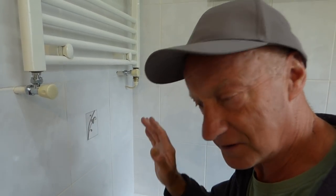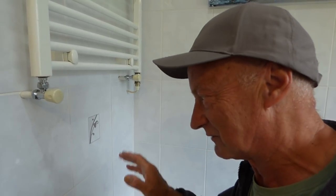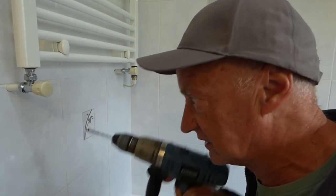And then you'll have to use plasterboard fixers. There's lots of different types of plasterboard fixers — I'm not going into those today, it's another subject altogether. But you put a plasterboard fixer in there and then fix your shelf to that. Okay, so with a solid wall like this I need to drill right in and use raw plugs. But we'll get on to that next and I'll show you this little trick with the tape.